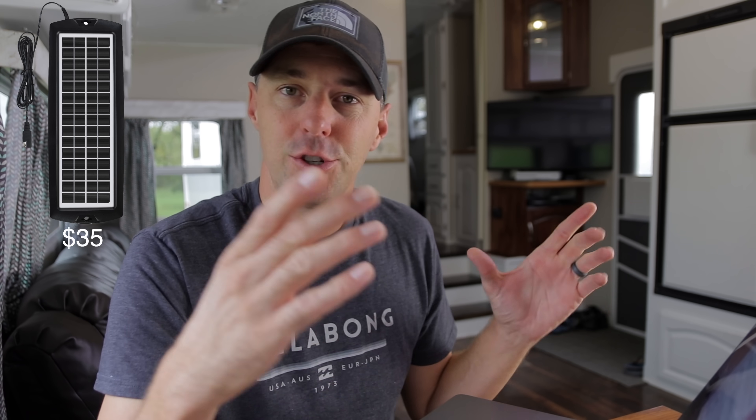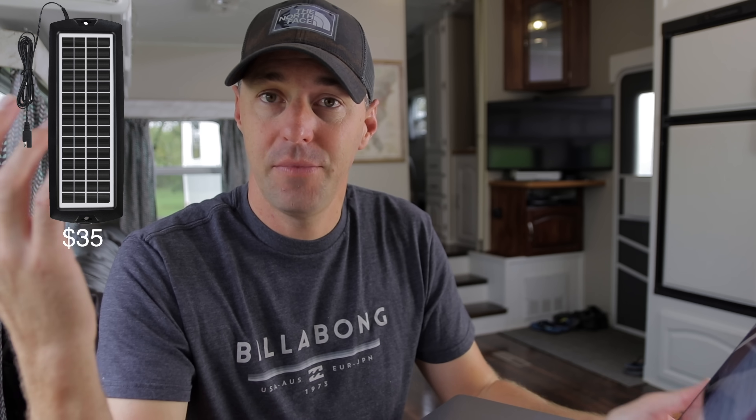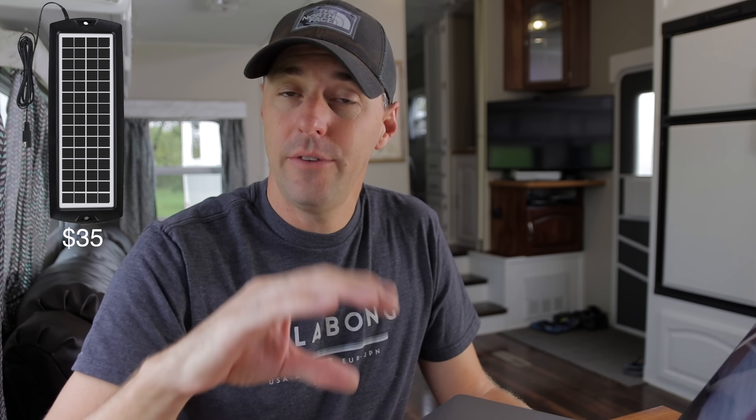Next question is from Bill: Is there a way to maintain the batteries during the winter months without pulling them out of the trailer? If you're not able to leave it plugged in all year — and if you have a single-stage converter, I don't recommend leaving it plugged in all the time because it'll boil your batteries — consider getting one of those small solar panel trickle chargers; I'll put a link in the description. It'll use energy from the sun to top off your batteries, replacing whatever they lose. It won't create massive power, but over the winter it'll keep those batteries from draining too low, preventing sulfation buildup and dead batteries come springtime.